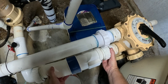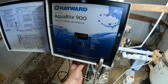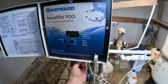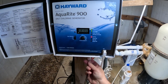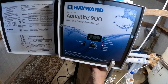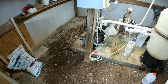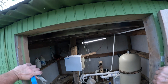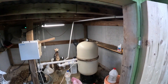That's a $900 bill I didn't want. Now I'll plug in the real flow switch. Watch — when I put it on auto it'll say no flow. If I plug it back in it still says no flow, but when I turn the pump on it'll switch. So what I'll do is order some cyanuric acid, put that in, and I'll let y'all know if that fixes it.